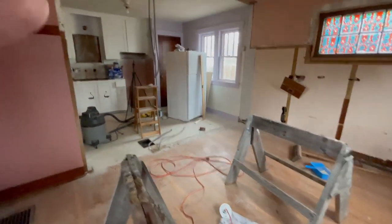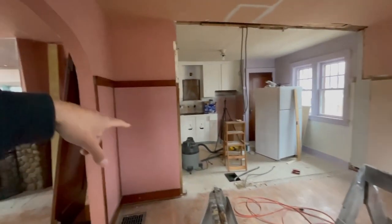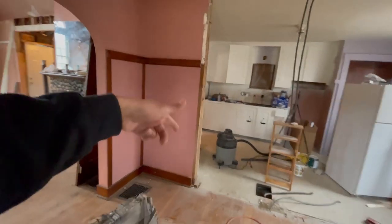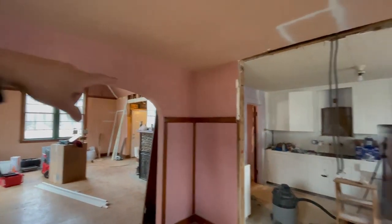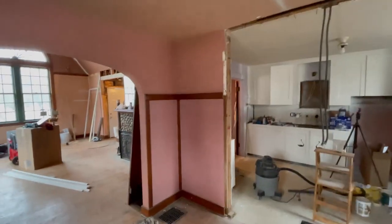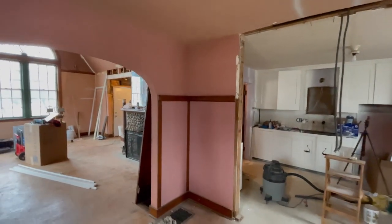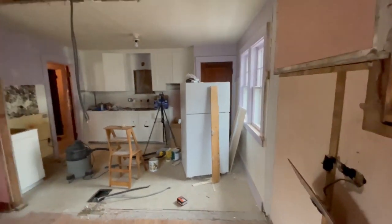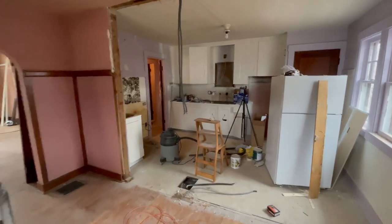This is the view between the kitchen and the dining room area. Now this wall we've got to leave in because the range is going to be there - there's a cabinet and a range there. This wall right here all the way across is actually load bearing, so we'd have to beam that if we were flipping the house. But since this is going to be a rental, this is how it's going to sit - we'll just patch this drywall and finish up the kitchen.